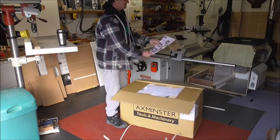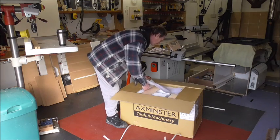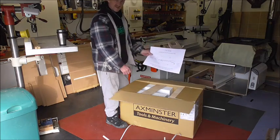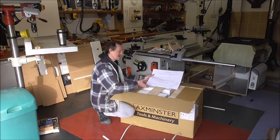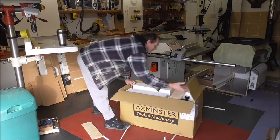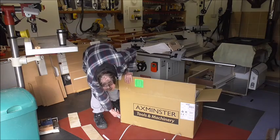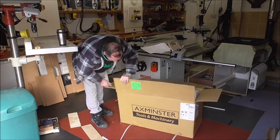We have one construction manual. Caution — do not lift by the upper arm. That's because we've got a quick-change system on it. The quick-change system basically means that the arm lifts up so you can change the blade quickly — quite unique. It's far better to slide the machine rather than lift it.